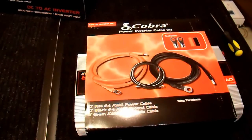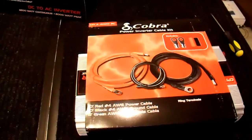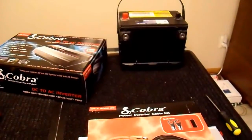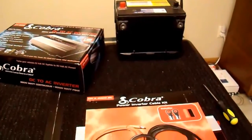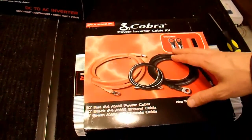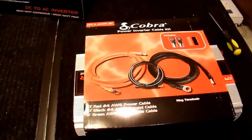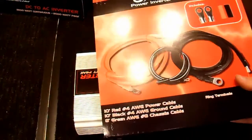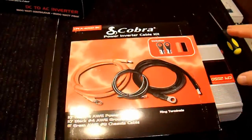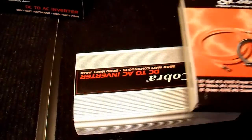That's before you account for any resistive heating in the cable, because copper has a temperature coefficient of about 0.4% per degree centigrade. You have to take that number and multiply it by about 1.5 to get the full heated cable resistance, which is going to be somewhere closer to about 2 volts. If you have a 12-volt battery that already has some internal resistance — for example, this automotive battery over here already has an internal resistance of probably 15 milliohms — you're going to get a pretty significant drop there. Add another 1.5 to 2 volts on top of it and your inverter is going to shut off.